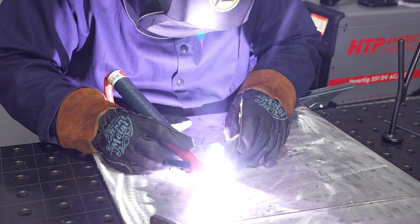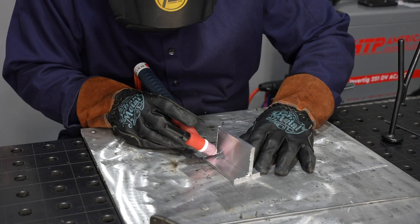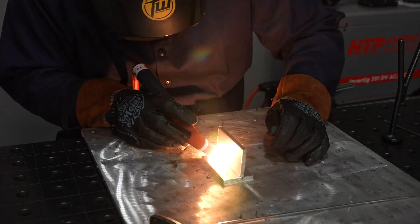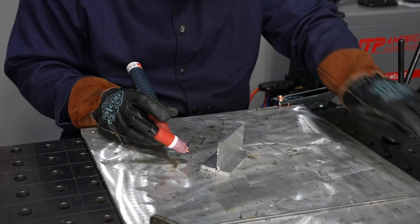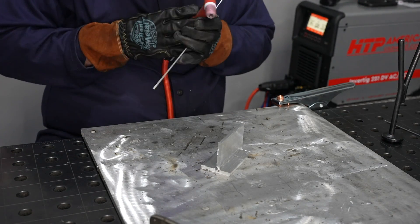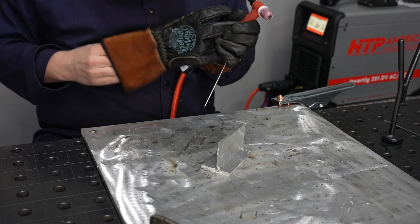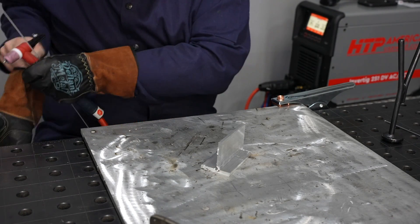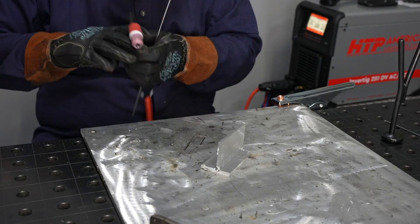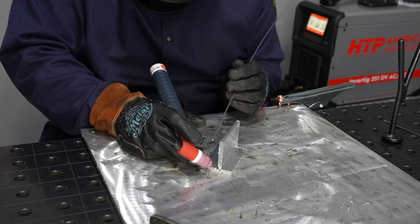Let's try this on the thick side — this is quarter inch thick aluminum, and that's where I think 250 amps is really a sweet spot because you can weld quarter inch without much messing around. I've had a 200-amp machine for many years and it can do quarter inch, but it's a struggle — you're really pushing the end of it. Going in cold I can run 250 amps with this air-cooled torch and it works great.